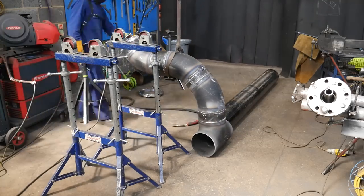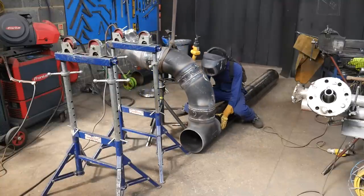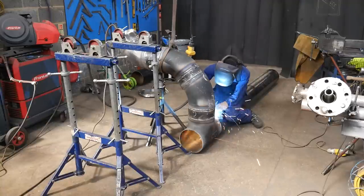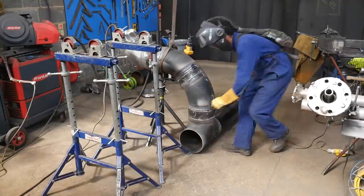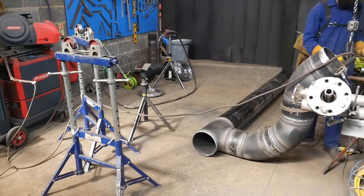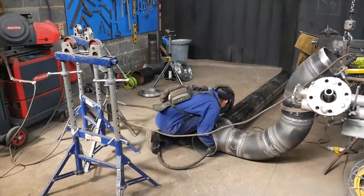Because this piece is so big I'm tacking it together on the floor. You can kind of see what I'm talking about with any positionals on these pieces — you wouldn't be able to get the correct orientation of the 45. In other words, instead of having a 45 that runs straight and true, you would end up having a rolling set and the 45 wouldn't be straight anymore.